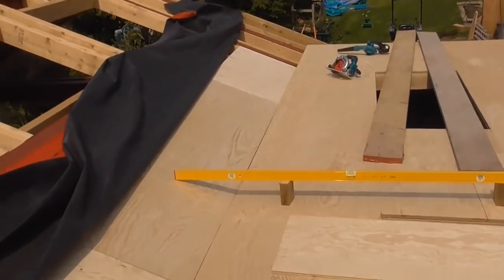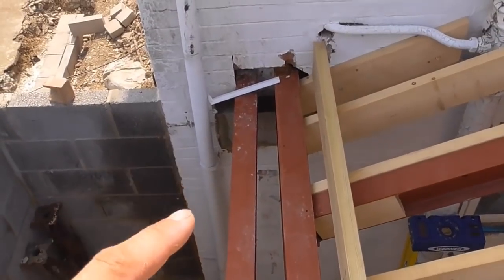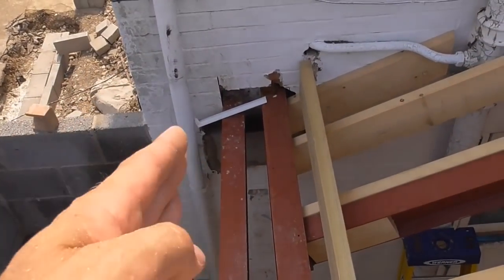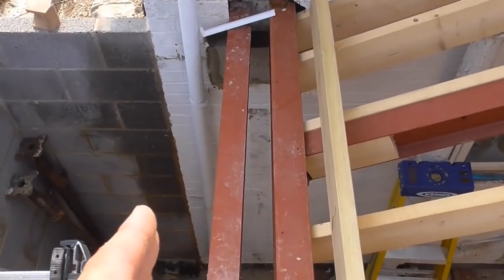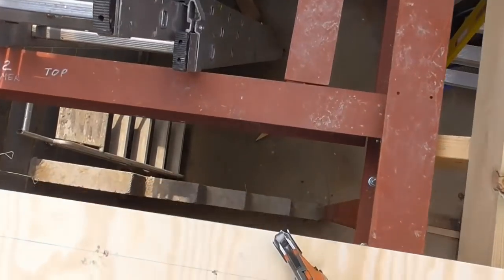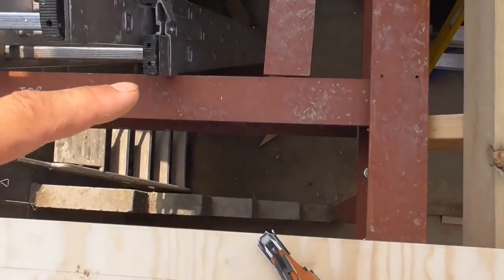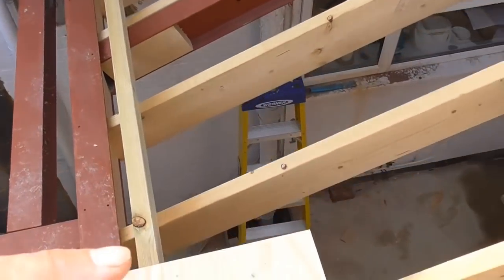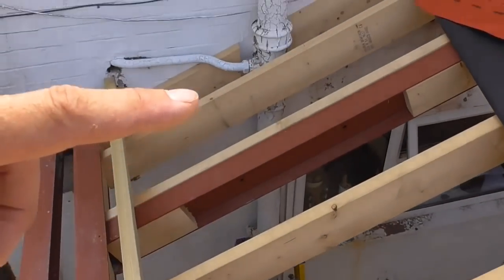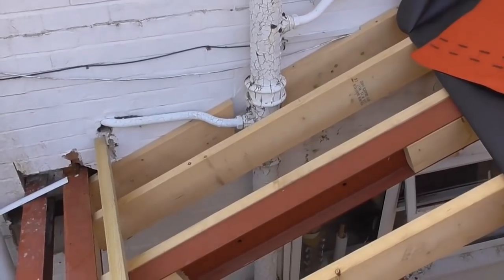So that's the most part of this boarded, and what I've got to work on now is there's going to be a back gutter in here. I don't know if you can see this steelwork. Excuse that, it's not parallel. The brickwork's just got to be knocked off because it's got an external skin of brickwork and an internal skin of blockwork. But what I've actually got to do, if you imagine this block wall has got to be brought all the way up, and the internal skin goes on that steel. So it basically forms a corner here. And what I've got to do is return this roof back to the wall, but put a fall on it because it's actually going to form a back gutter in here.